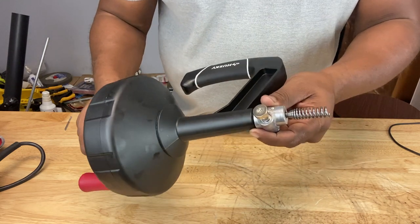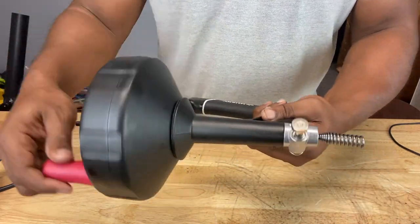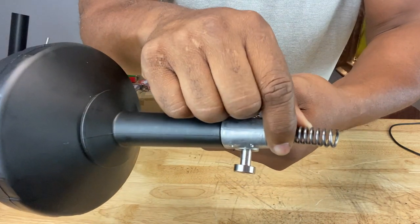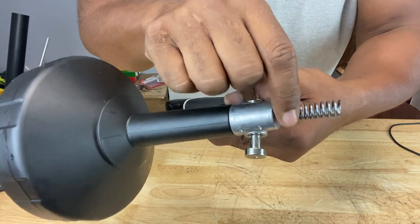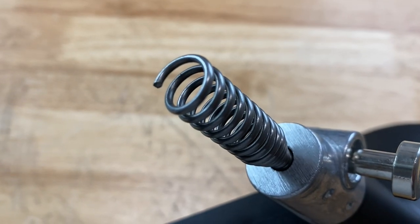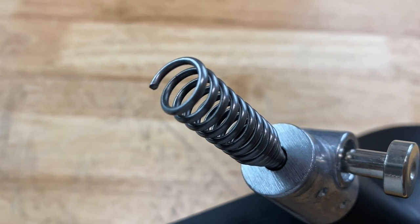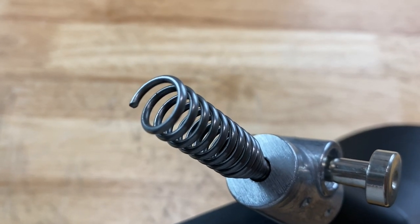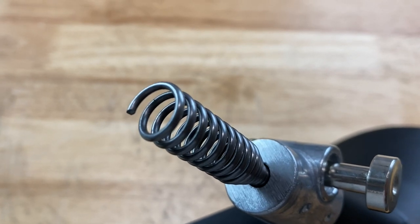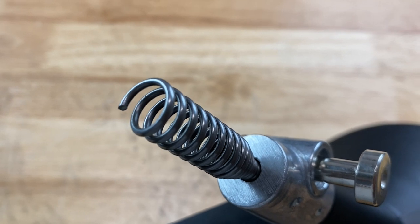You can just call this a drain cleaner, because that's what it is. Here's the handle that you use to spin the auger or drain cleaner, which allows the helical portion — the spiral-like spring portion — to grab onto whatever's clogging your drain. Here's a closer look at the tip of the auger bit. It looks like somebody just snapped off the spring at a certain point, and that's designed that way to make it easier for the auger bit to hook into the debris, penetrate it, and pull it out, unclog it, or just go through it.